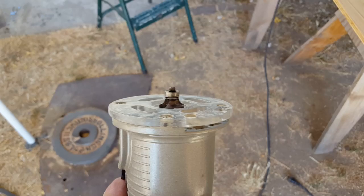I started creating different pop-outs by ripping down scrap two-by-fours, two-by-sixes, and plywood to create different kinds of trim. I used lots of different router bits — flush trim bits, chamfer bits, cove, and round-over. If you have any of those routers or router bits, it's definitely cheaper to create your own decorative edging and molding than to go buy a piece from Home Depot or Lowe's. Because we were trying to match these columns as closely as possible, I did break down and buy some crown molding, ripped down little pieces on the table saw, and used our router table — it really did save quite a bit of money.